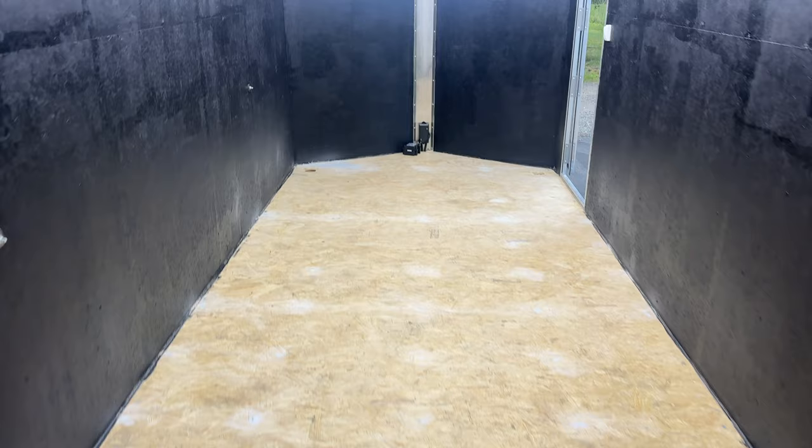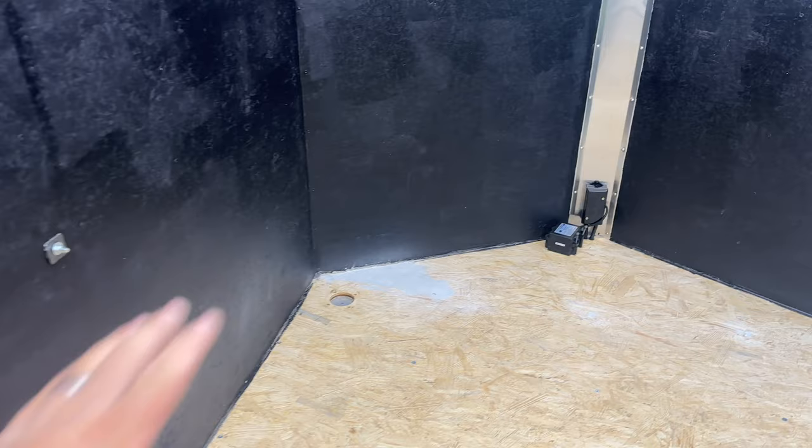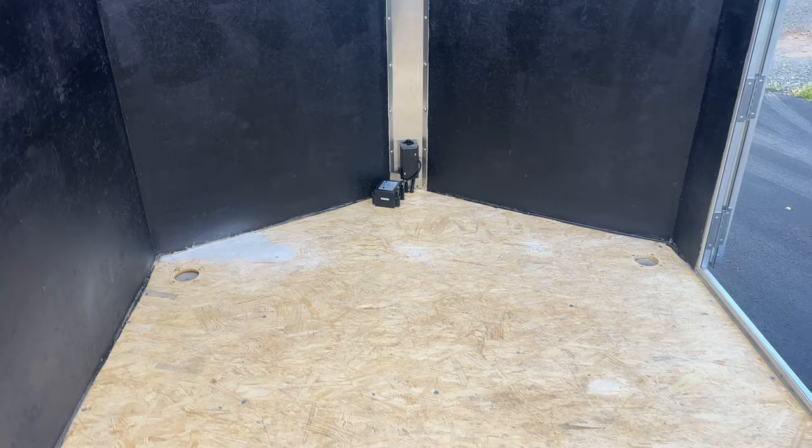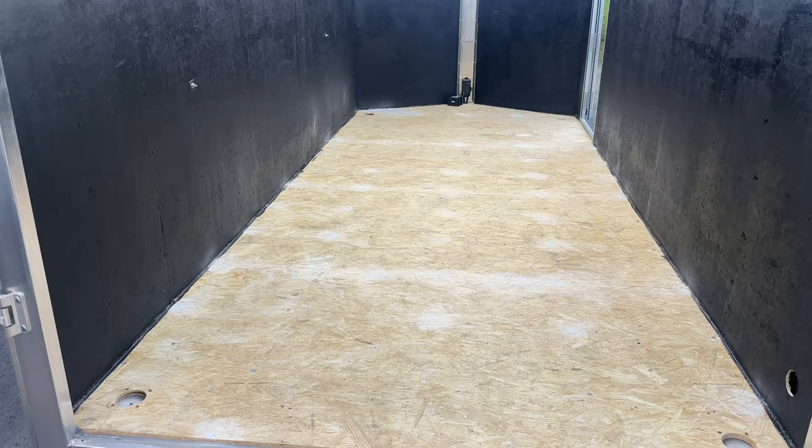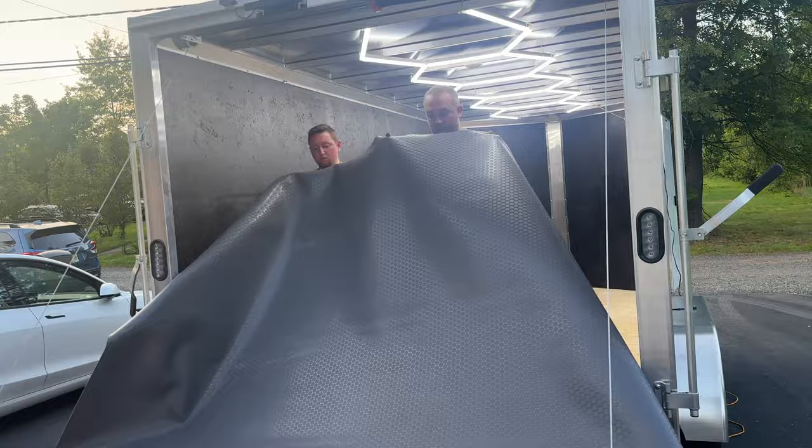I have spent a few hours and I might have gone overboard, but I filled every single hole, recessed every single one of the screws, and every time that a board met each other I filled in that crack and sanded it well so that I have a perfectly flat surface. I put a whole bunch of Bondo in that corner that was really low and feathered it out with my sander so I don't have a low spot. I'm a little disappointed in the manufacturer of this trailer, but you do what you have to do to make your flooring look perfect. Let's go ahead, get the flooring, and roll it out so it can acclimate over the next few hours.